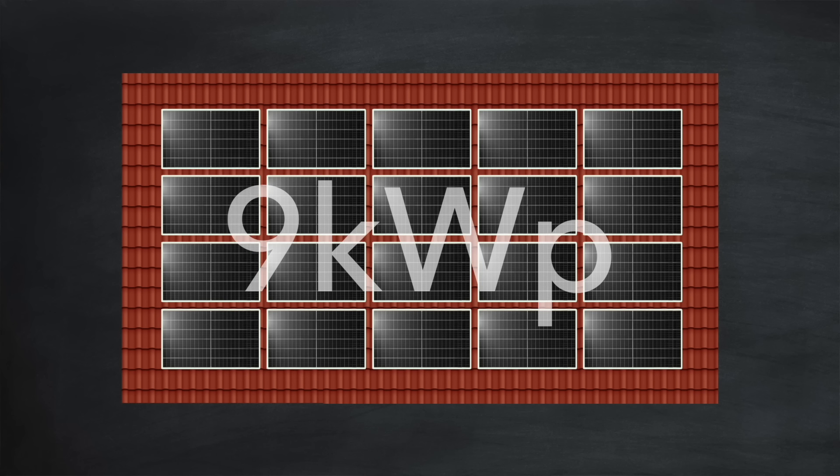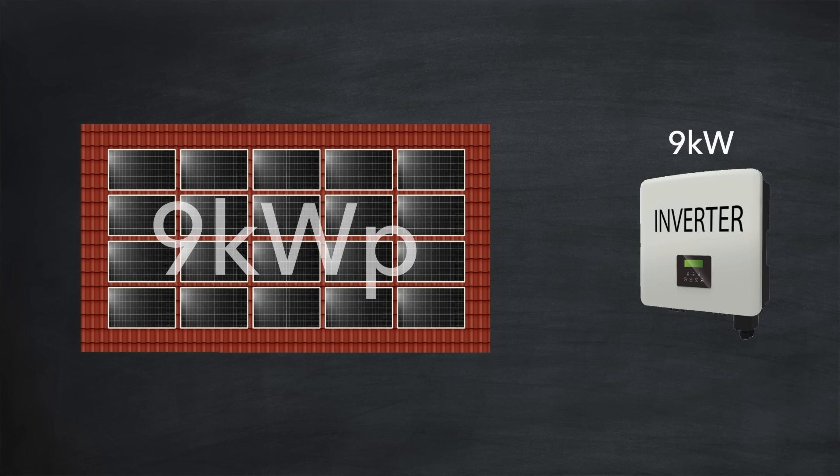You might be thinking that now you're going to need a much bigger inverter — perhaps a 9 kilowatt inverter to match the panels instead of say 6 kilowatts. And your local energy network provider might even limit you to a 6 kilowatt inverter anyway, so what's the point of having more panels? Well, there are quite a number of benefits to having your solar array size bigger than your inverter size. And don't worry — by oversizing you won't blow up your inverter on a very sunny day, so long as you respect the array oversizing parameters we'll talk about later.